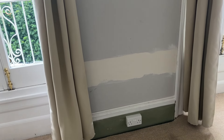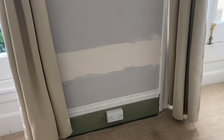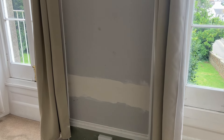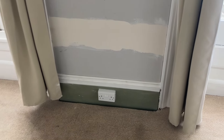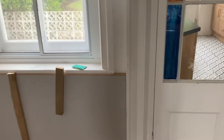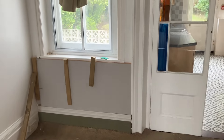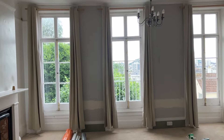For some reason my painter doesn't like painting dry lining, so I have to fill it and sand it — otherwise he tries getting the plaster and then sends me a bill. I don't understand why he does it; he's good in other ways but he doesn't like doing dry lining. There's no need to plaster it — we can just give that a sand and get it ready for painting. I had to put a beading across the top of this just to finish it off so you can't see the plasterboard or the thermal board behind it. Once that's gone off I can take the timbers off and I'll probably give it a mist coat of paint just to please the painter. I've just had a delivery — we've got lots of pipe and lots of fittings, so I can start with that — but I think we'll do that as another video.